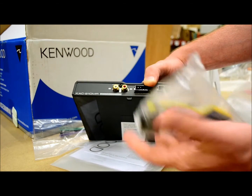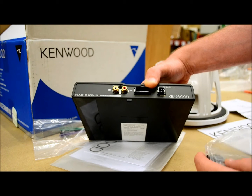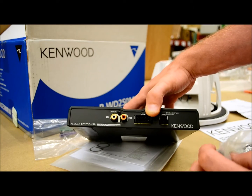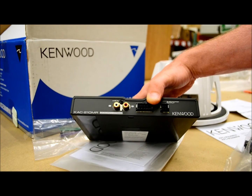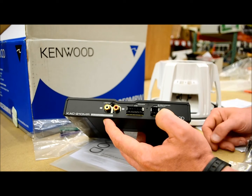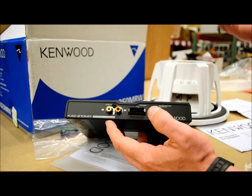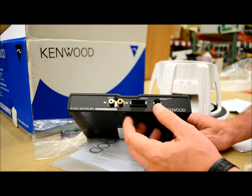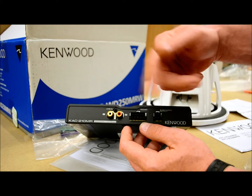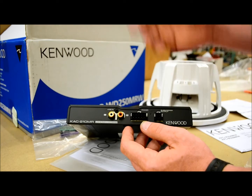I don't know what's up with that — I don't know if that started in 2013. I haven't been paying close attention to these units for the last couple of years. However, it's noteworthy: if you only have a basic or cheap radio that came with your boat, you're going to need to get yourself a line level converter to convert your radio's speaker level outputs to the RCA inputs.